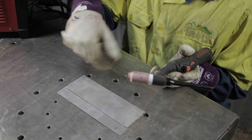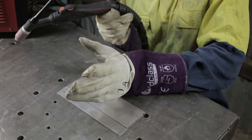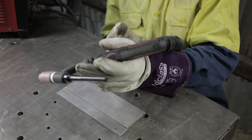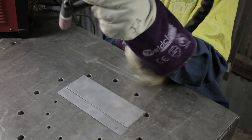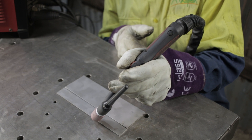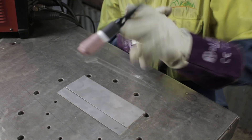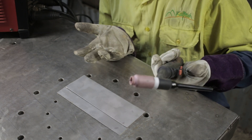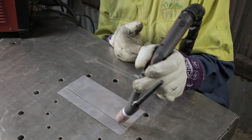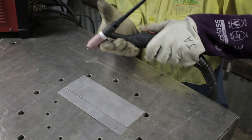How I recommend holding the torch is kind of like a pool cue — just rest your hand open like that and drop it in. Your thumb pinches it, the fingers up here support it, and this finger becomes the trigger finger. What that allows you to do is prop your arm against the edge of the bench and move quite a long way in one position. It's comfortable — I'm not having to hold my hand up and rely on all of this part of my body to remain completely still. When I used to TIG weld the other way, just breathing was enough to throw me off and ruin the weld. This brings all of your bodily movement back to one point wherever you're propping. That is how I recommend most people TIG weld — unless you're walking the cup.